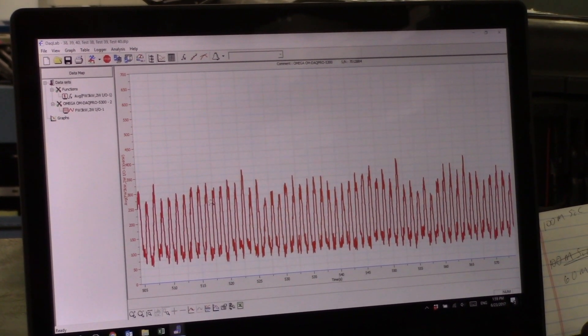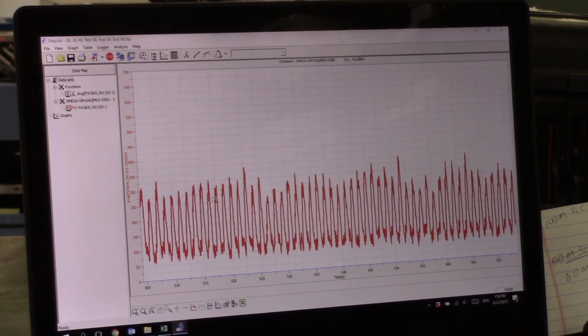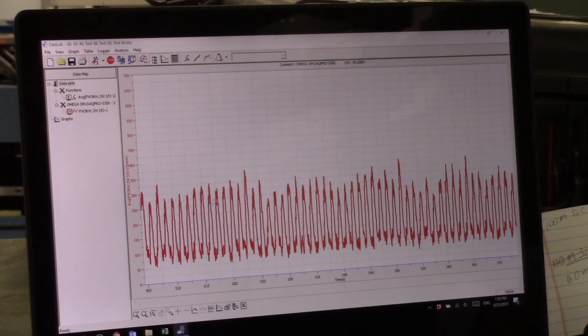In the coming weeks we're going to explore these relationships to determine the best approach: true as quickly as possible with the smallest forces possible to avoid chatter risk. We'll do a comprehensive evaluation and hopefully develop a parameter spreadsheet so that given your goals, you can identify the best combination of grit size, aggressiveness, and relative grit size to achieve the quickest removal without generating excessive forces on your spindle.